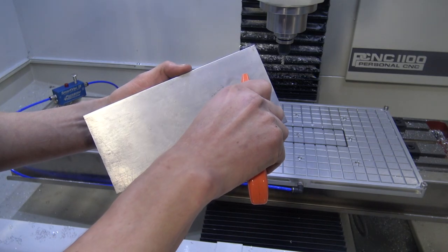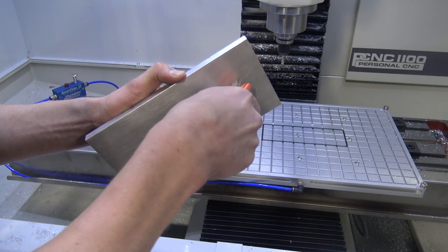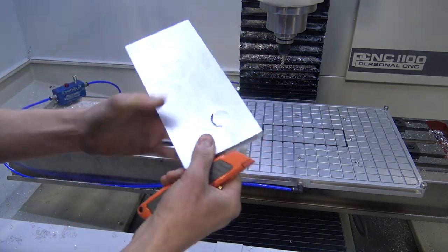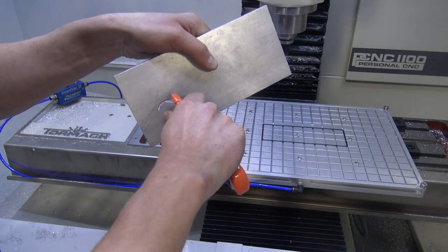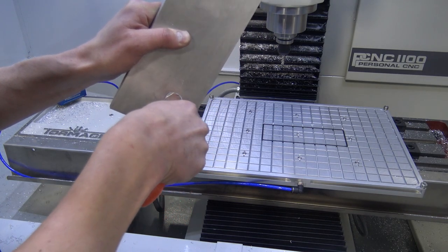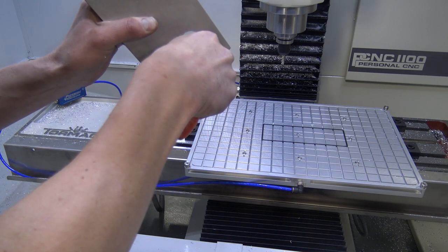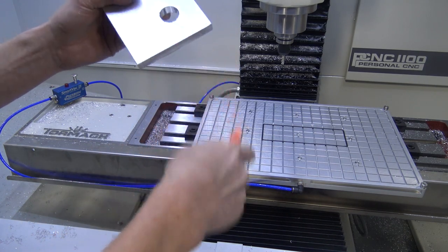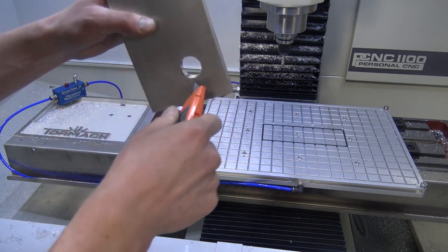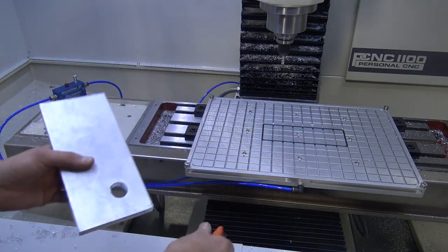Sharp box cutter. The problem, in my experience, is that the more flange stuff left, the harder it is to get a good crisp cut with a deburring tool, and that's what we're going for here. This might work — it's certainly thin. We're going to experiment; more videos to come on how close can we cut it and still hold vacuum. Actually, did a good job on the right side, not so much over here. Not the right tool for this — deburring tool.